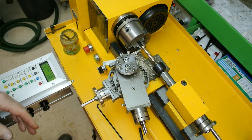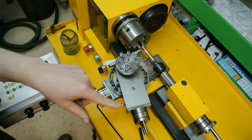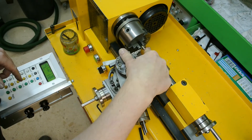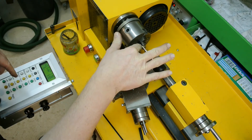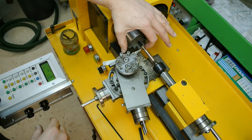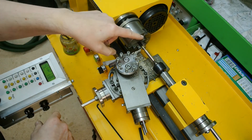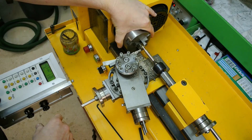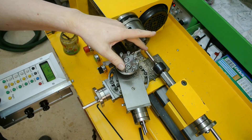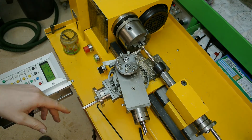As you have seen, I had forgotten to fix the carriage in the beginning, but after fixing that, all the cuts went very well. I could reach the positions again repeatedly and was able to cut really very near to the chuck — everything as expected. I think that shows the applications of the x-axis control very well.